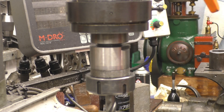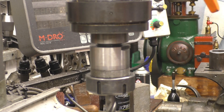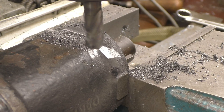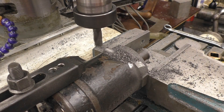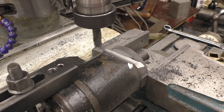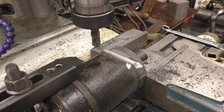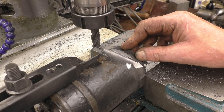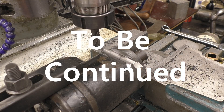You'll notice when I was grinding that, the sparks at first were very bright, fiery sparks — because that had been welded with a nickel rod. When I got down to the cast iron I got the normal dull cast iron type of sparks. You could weld the plate onto the steel bit, depending on what sort of seal is in there, but I think just clamping on there is going to be sufficient to hold it.